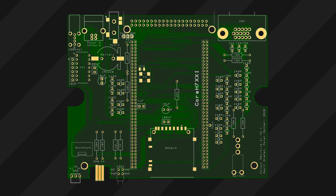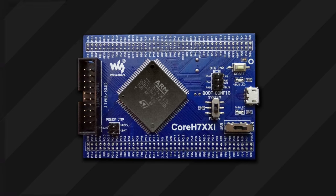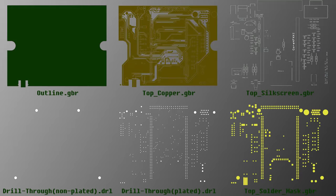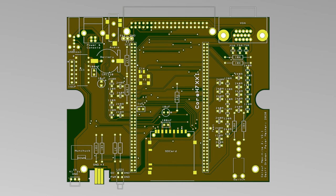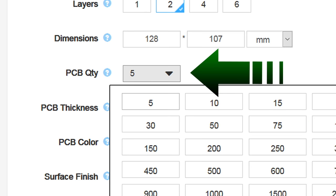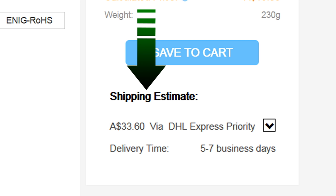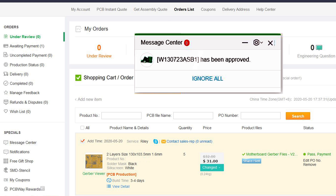The computer requires three elements: a DIY motherboard which handles all the input and output duties, a Waveshare board containing a CPU and memory, and a copy of the Maximite firmware. Luckily, I was able to get the PCB Gerber files, which combine to create all the steps of making a PCB, including a white overlay showing where the components go. The minimum order for this particular size of PCB was five units, and by the time I added faster shipping things did get a little pricier. But uploading the board files was easy and it was apparently checked and approved straight away.